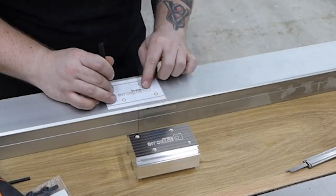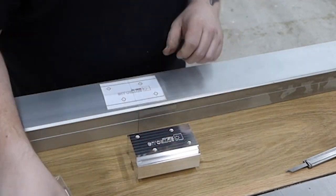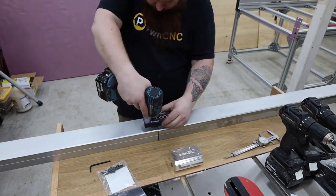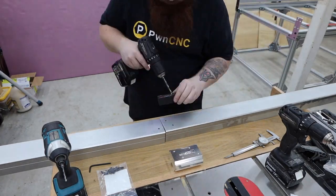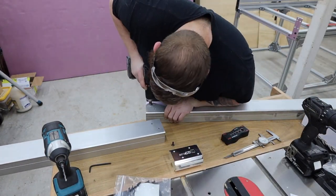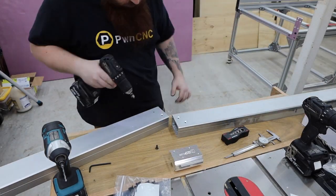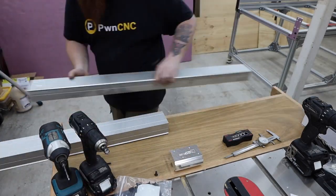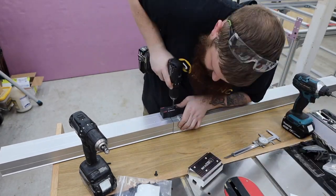You'll notice me flipping the block with the materials so I don't mess this step up. It would probably be easier to tape them on, but I didn't have any handy at the time. I can't stress this enough — take your time here. It's best to use a drill press, but an inexpensive drill guide will also work. I started with a 1/8 inch pilot hole and went up to a 1/4 inch bit. I later went up to a 5/16 inch just to allow a little bit of room for the bolts to get in easier. Just make sure the holes are perfectly centered exactly where the templates say they should be.